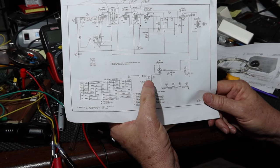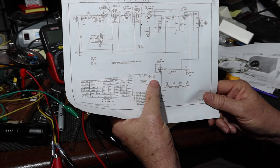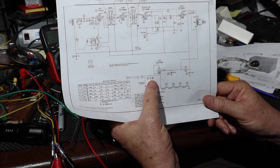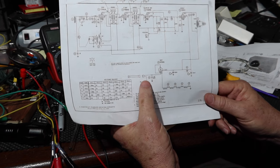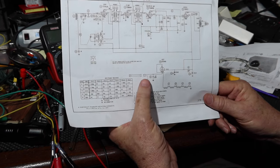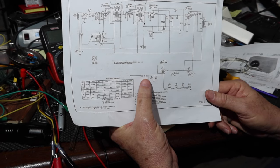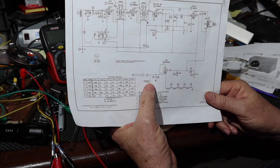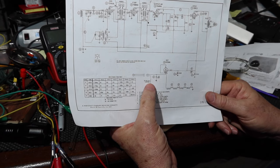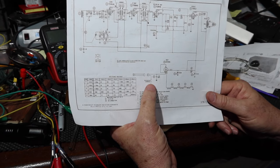And you put in a safety capacitor, which I've done, and then maybe that's it. And you leave this like it is. And so you say, okay, what's wrong with that? All right, so what's wrong with that is that this can be plugged in to where either the switch gets the neutral or the switch gets the hot.